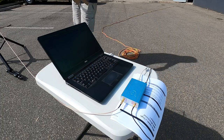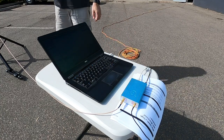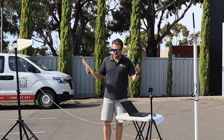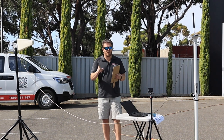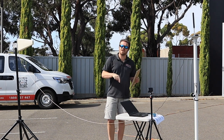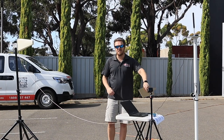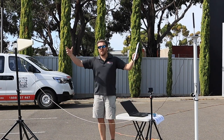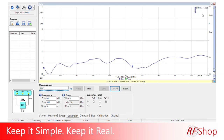What I have here is my test setup. I have a VNA — a vector network analyzer — the blue box here from MediQ, a company in the Netherlands. I'll do some demos on that setup soon. This is a poor man's antenna test setup, but it works quite well. The vector network analyzer sends a signal from one port to one antenna, which transmits; the other antenna picks it up and sends it back to the VNA, and what we see on the computer screen is the effect of that loop.